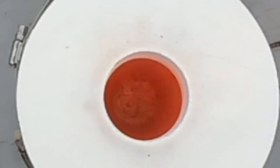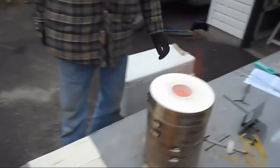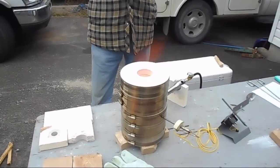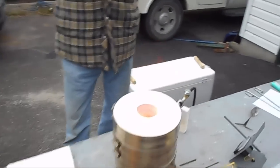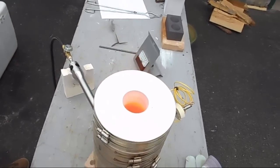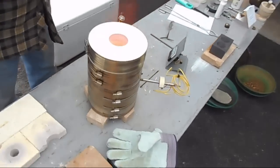There's quite a different flame in there — you can see it coming out. We're at 1900. The book says that the pyrometer is measuring the temperature of the flame, not the temperature of the kiln itself — so everything has to be glowing the same color. The crucible is just starting to glow nicely. How easy was it to hold the crucible with those tongs? It was fine, quite stable — you think you can pour okay with it?